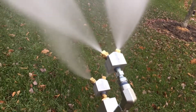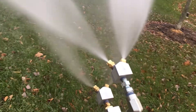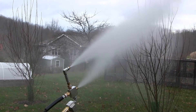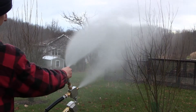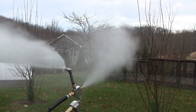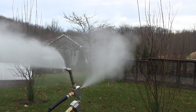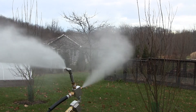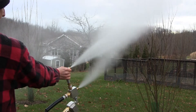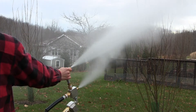We can see evidence of this by the way the nucleation plume is seemingly pulled up into the bulk water plume. It's a bit difficult to see because it was pretty windy today, but in this example, as I move the bulk water nozzle to the side, we see that the nucleation plume shoots roughly parallel to the nozzle. But when I move the bulk water nozzle back in line with the nucleation nozzle, the nucleation plume arcs upward into the bulk water stream.